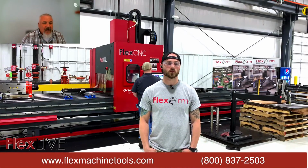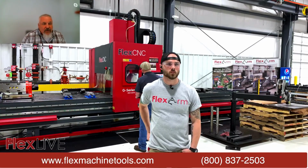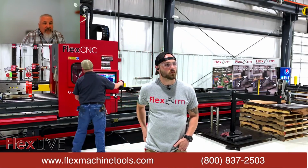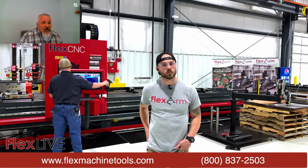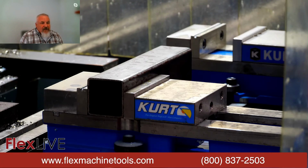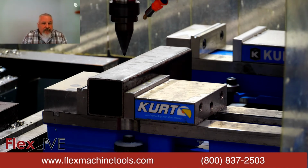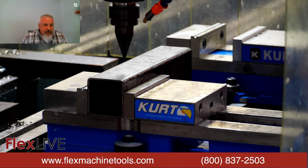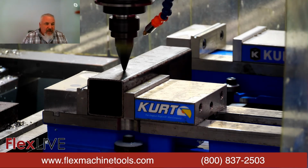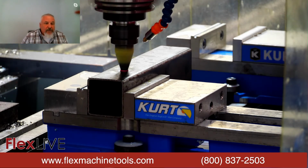It also kind of depends on the wall thickness you're working with. As we get into the larger diameters, we can of course go through thicker wall material, and that's going to generate more heat in itself. But with the thinner walls that we're doing here today, it doesn't hurt a thing on a 1 inch or larger bit diameter to do a little preheat operation. With that said, you don't need to bring it to a cherry red. Just put a little bit of heat in there, and that'll help considerably.